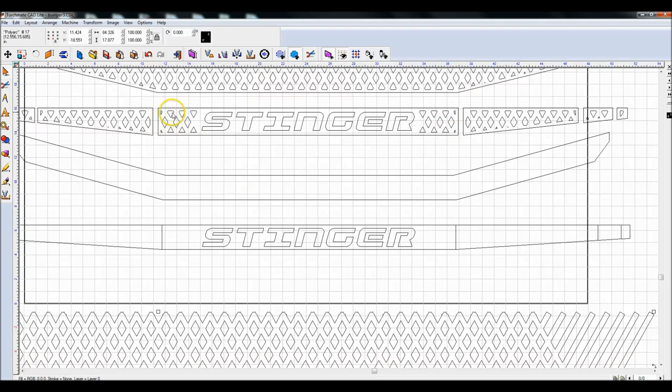If I didn't do that, these welds would actually come straight to the edge and be cut straight out, and it'd just have a jagged edge and everything. So you want to give this a little buffer. And here's a cool trick. If you want to make the buffer on the outside of your object that you created, then you'll create a male tool path. If you want to create it on the inside, you create a female tool path.